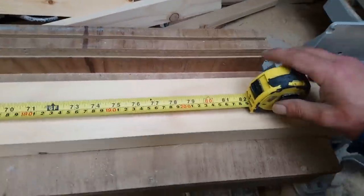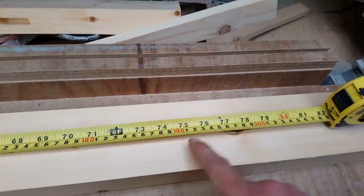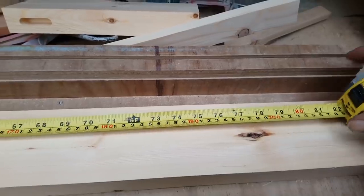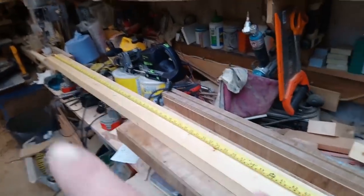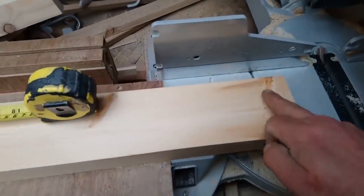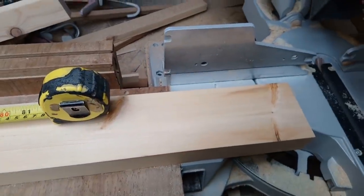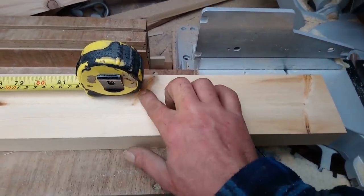This is the first one off the rack. And 1995 is there, 1900's there. You see I've got knots here, but down here, that's clean, and at this end's clean, so I'll square it just a little bit further than that, and when I flip it round I'll clean that end up when I cut it to length. You don't really want these sort of things, knots and what have you, where you're going to be making your joints. If this was only just long enough, I'd trim that end off, maybe put the joint there. Ignore that one.